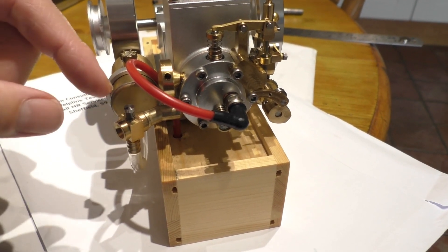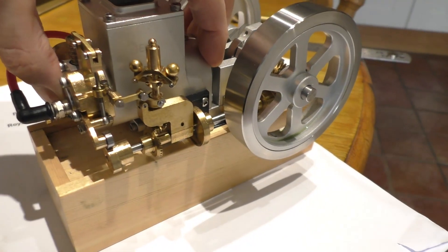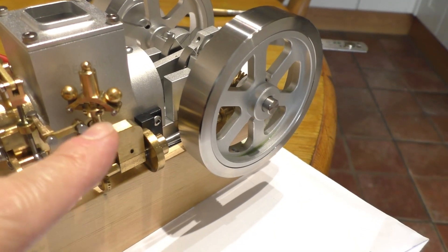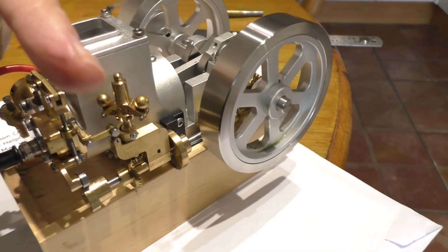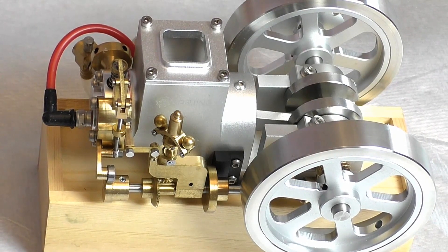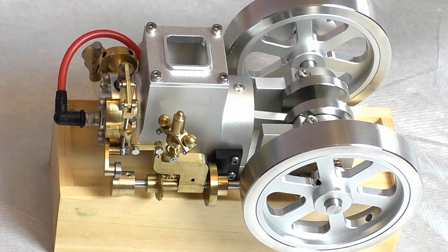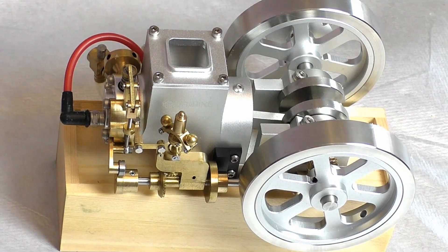There is a third video if you're interested — when I first got the model I did have a little bit of trouble getting it to start, and I'll leave a link in the description. It's on my sister channel Freddy in the Shed 2. Anyway, let me explain how this engine works. Unlike a standard four-stroke petrol engine that fires every time it reaches the compression stroke, this hit-and-miss engine doesn't — it will typically only fire on every five to six cycles, and the rest of the time it's idling.